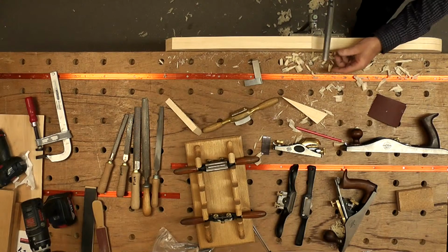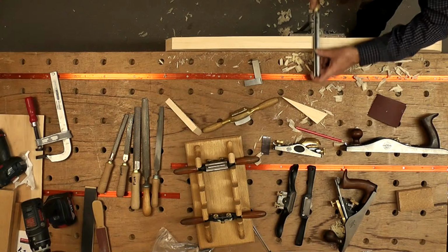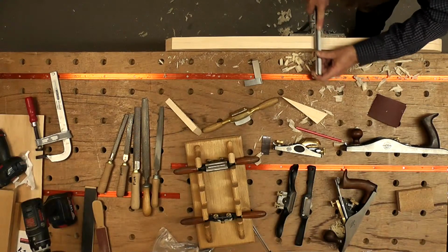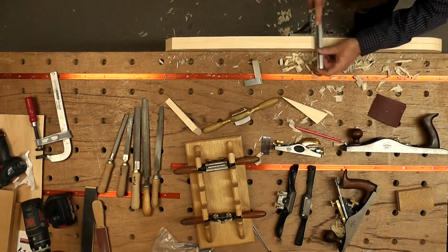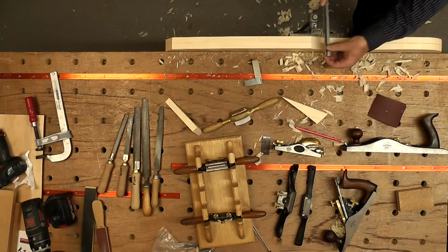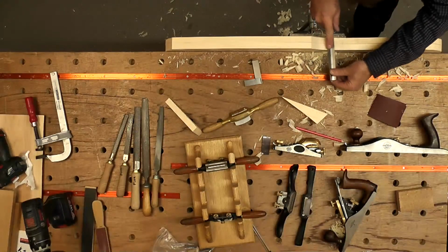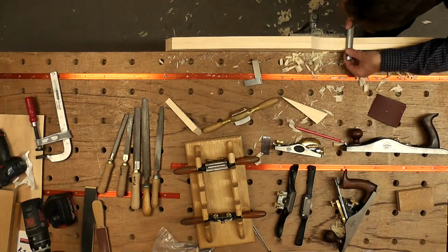Now this is still a cutting tool. It's quite amazing that fact we can cut across. I can come gently coming down those fibres, trying to build my curve, and again I'm monitoring the square edge at the top to see what's happening. Now this one is extra fine, so it's quite a good one to go with for the pine. We don't want anything too aggressive. I can work either direction, as in coming up the curve, coming down it. It won't tear the fibres. We can blend things in.